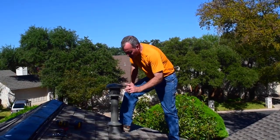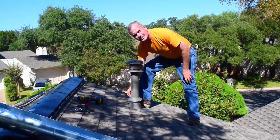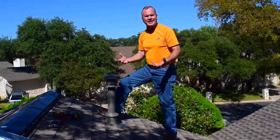It's so commonly a leak source because they take this little storm collar and they simply caulk around it. What does that do when it's heating up and cooling off ten times a day, plus the sun in Texas? It simply breaks. By the time the rains come, you have a leak right down into the house, often destroying the drywall and getting more wet.